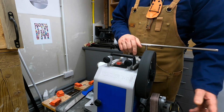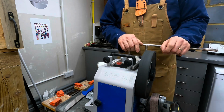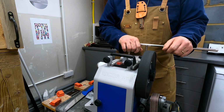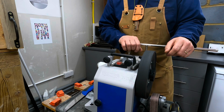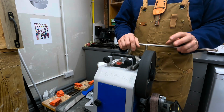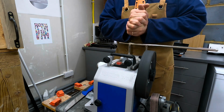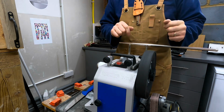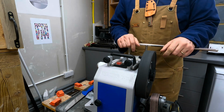I would love to hear that, because basically once my apex is set, the Work Sharp goes away. I don't tend to use it beyond then. So even my extra fine grinding belts hardly get any use. At the end of the honing process, next step for me is to clean the edges off. So literally clean them up, with a paper towel, or sometimes with a bit of isopropanol if there's any compound on the steel, and then over to my hanging strop.